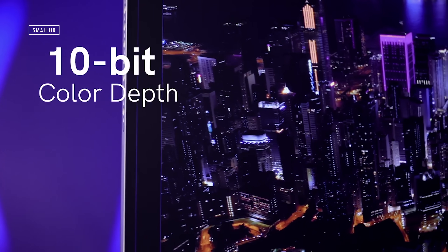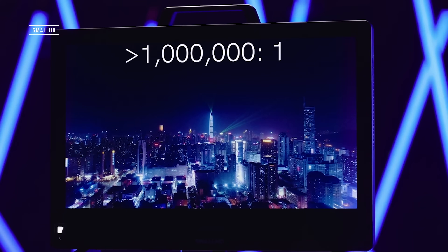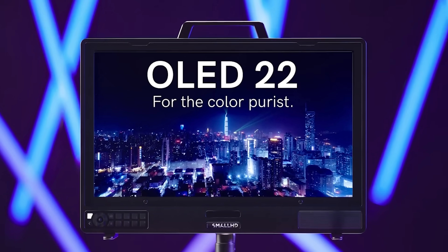Amazingly enough, true RGB OLED displays are only used in reference monitors that cost tens of thousands of dollars — presumably because movie makers are willing to pay up for the best no matter the cost. So you might be thinking: if the blue OLED compound wears out fastest, then why are they using blue? And doesn't that mean bad things for QD OLED? Well, first, don't forget that W OLED is also entirely based on blue OLEDs — they just get used differently. And blue OLEDs are used because they have the highest energy waveform, therefore providing the highest brightness potential and doing the best job of activating the quantum dots.